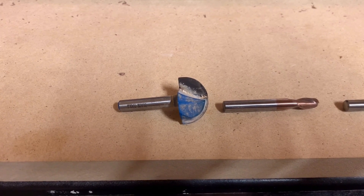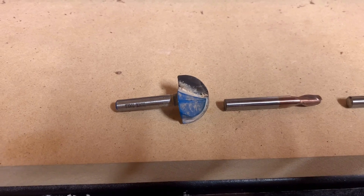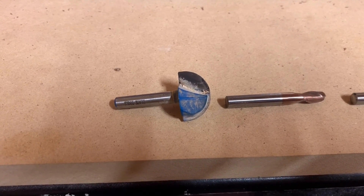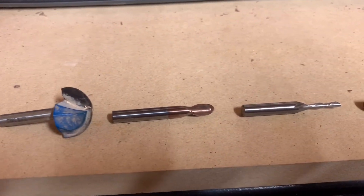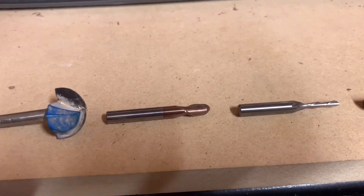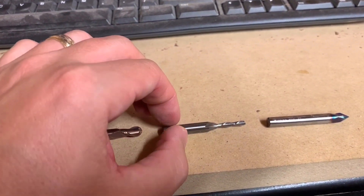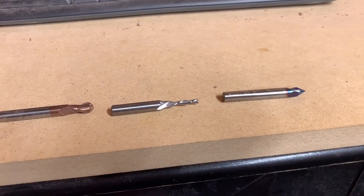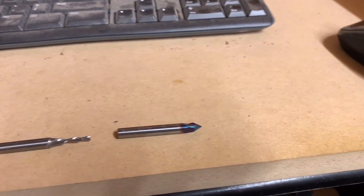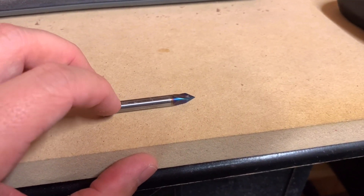Now I'm going to show you the tool bits that I actually use. I'll start with the one inch cove bit — just a common cove bit you could find at a local hardware store, though I purchased mine on Amazon. It works really well at taking a lot of material out quickly. Next is the quarter inch ball nose bit — I use this for my detail pass, and it leaves a really nice smooth finish at the 8% step over. For the roughing pass on the stars and stripes, I use a Whiteside eighth inch down cut bit. And last up is my 60 degree V-bit — the spectra coated V-bit by Amana Tools, purchased through Tools Today on Amazon. I'll link all of these in the description.